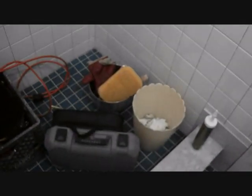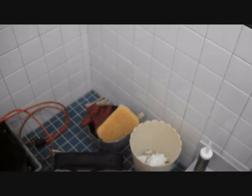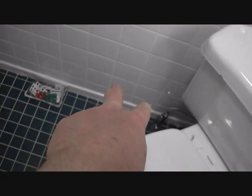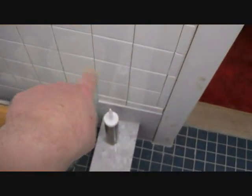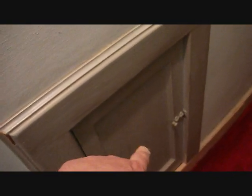The other bathroom won't cost as much because, as I've said before, I've got a lot of things already done in the other bathroom. I had already done the bathroom fan and outside ventilation. The electrical is done. Electrical's effectively already new in there. And what else is there? Up the chase over here, I brought the two new 3/4 inch hot and colds that go like that and then turn, and they go through the floor joists, and then they go in there and then they shoot out. And I got brand new water lines terminating behind this 1928 service panel for the bathtub.